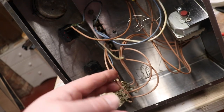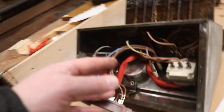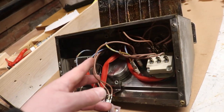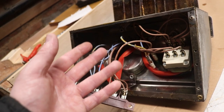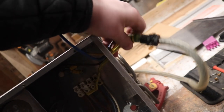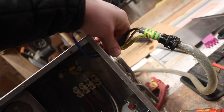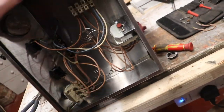If we convert this to three phase, then a 2.5mm cable will be enough to supply the power for this system. That's quite fortunate because I think I've got a 4mm cable running into the kitchen itself, which should hopefully carry all of the electrical requirements to power four of these. So I need to convert this over to three phase — there's another one to do next door. I'll pull this single-phase cable out because it won't be used in this appliance again — nice bit of armoured cable there.